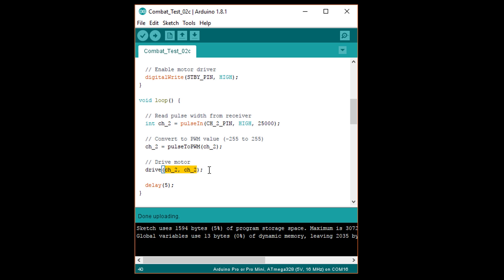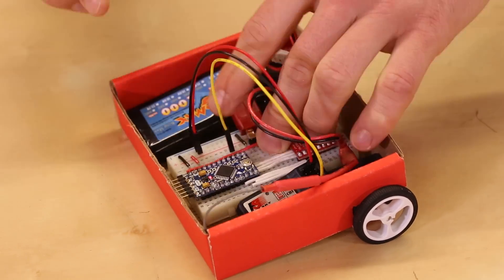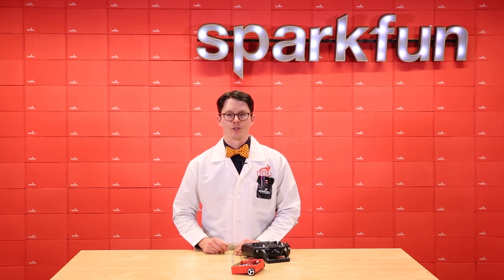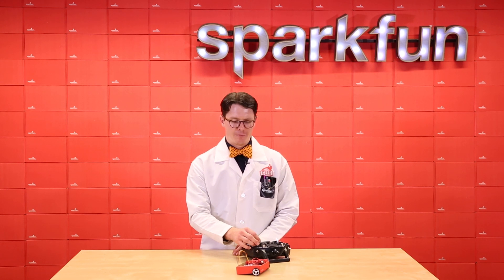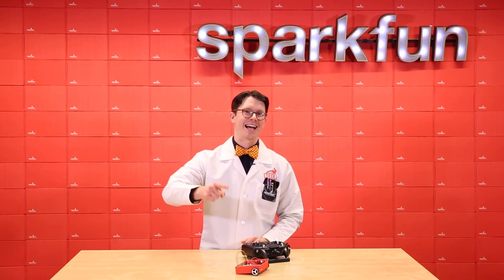All this code can be found in the description. Upload this to your Arduino. Once you've programmed the Arduino, remove the FTDI breakout and attach the LiPo battery. Now we can move the control stick to drive the robot back and forth. You can buy an electronic speed control to do all this PWM and mixing for you, but that takes the fun out of learning how to use an RC receiver. This back-and-forth driving won't win you any combat matches, but it's a start. Next time, I'll show you how to mix a second channel to allow for steering. Good luck, and happy hacking.